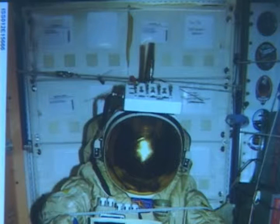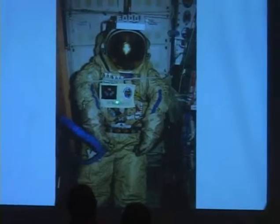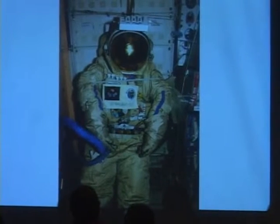One is for power on-off, and then to enable 2 timers because we wanted to make sure that SuitSat did not transmit for about 8 minutes, giving it a chance to get deployed away from the astronaut and cosmonaut and not cause any RF transmission in their vicinity. The equipment was actually in the waist section. If you look carefully, you'll see here the arms. Basically, the cable comes down and it goes up the arm and then inside the suit itself. On the outside of the suit is a patch and a CD-ROM with artwork from school kids around the world.